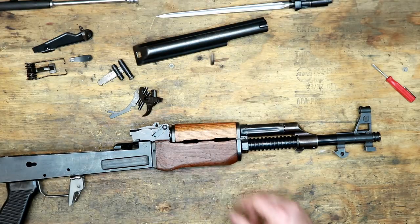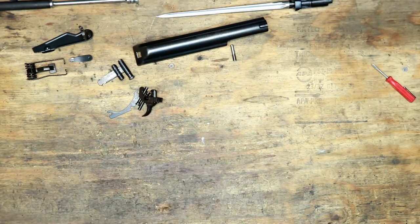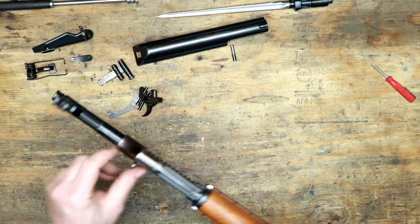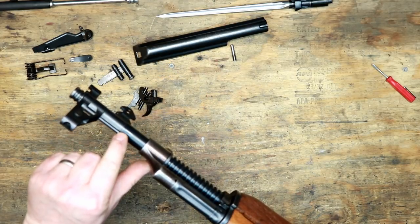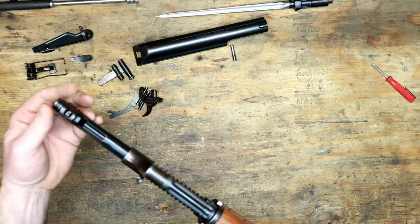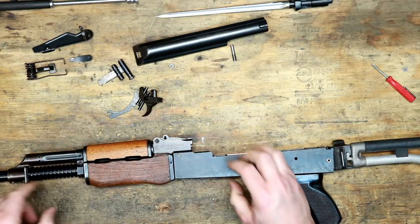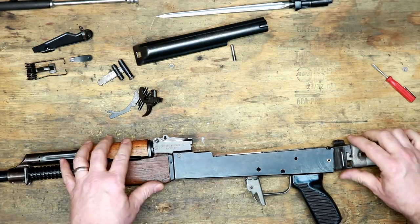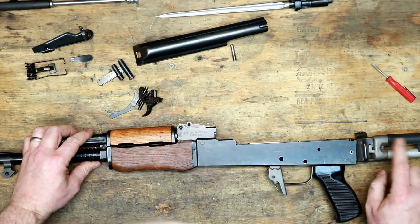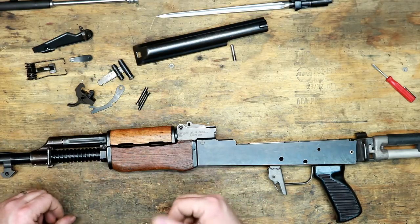Wasn't expecting that. Anywho. Alright, let's put it together. Like I said, I gotta go shoot it. It's not drilled or pinned or anything yet. I've got two lines put on here with electro pencil. Let's see if it moves while I shoot it. It shouldn't. It's fairly tight. It should be a half thousandths, but it's like a thousandths press fit. Yeah, let's do something with that. That's horrible. I might make some little bronze sleeves or something to go in there.